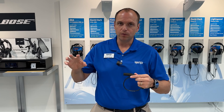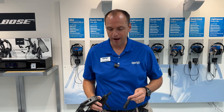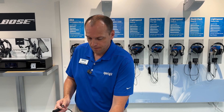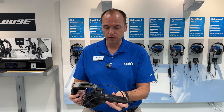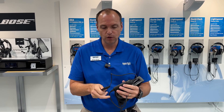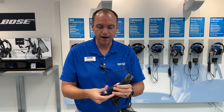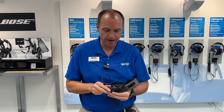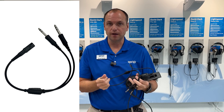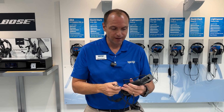The issue comes when I want to adapt a headset that has a panel-powered plug back to a GA aircraft — usually that's a simple operation of getting a certain adapter. However, we insert the idea of power. The Bose A20 is unique in that it's a Lemo-powered headset but still has an ANR box with a battery pack containing two AA batteries. So in the event I lose power from the panel, I can use those batteries, meaning I can use a simple Lemo-to-GA adapter to hook my Bose A20 into a standard GA cockpit.